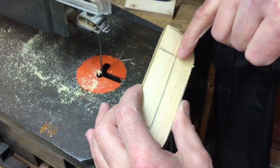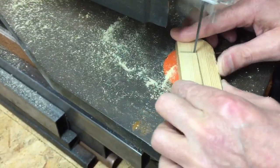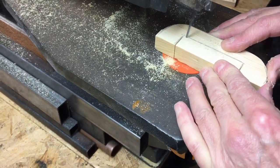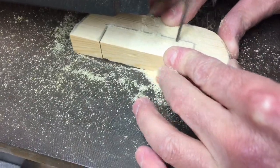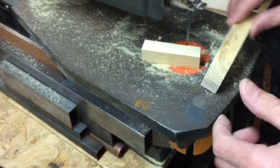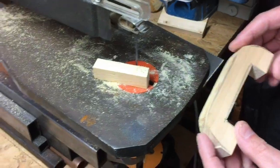You can go in the hole and then gradually turn it under power. Don't try and turn it too fast. There you go — it's not a science, it's quite easy. Then you can sand that on a power sander if you've got one, or do it by hand with sandpaper.